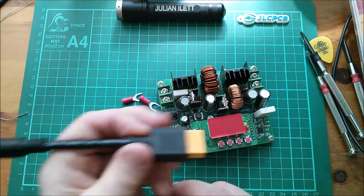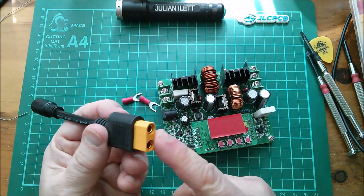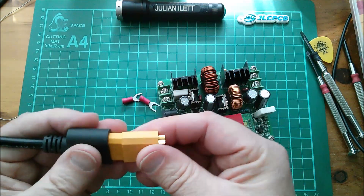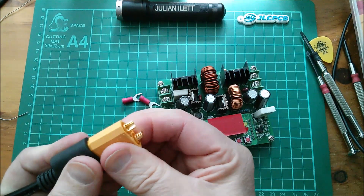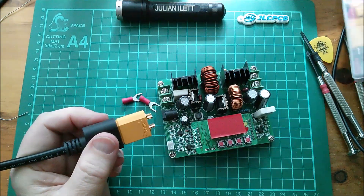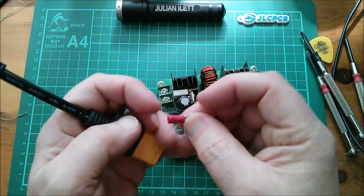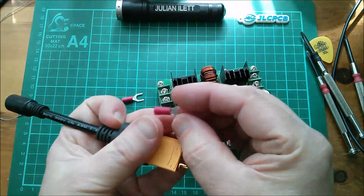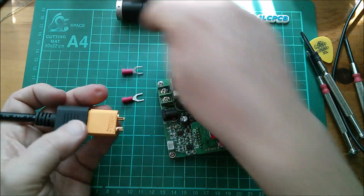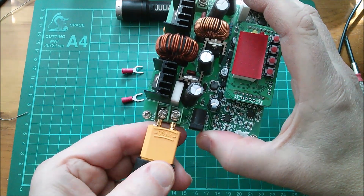This is a quickie really. I've got this — it came from PowerOak with the big two kilowatt power pack — and then I bought some XT90s on Amazon so I can plug into there. They move a bit, they're not riveted completely firmly into the plastic, but whatever. I was wondering if I could take the red things off and solder these without pieces of wire straight into these ends.